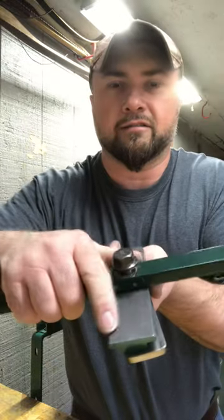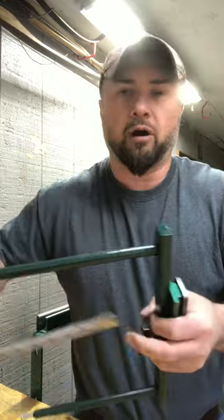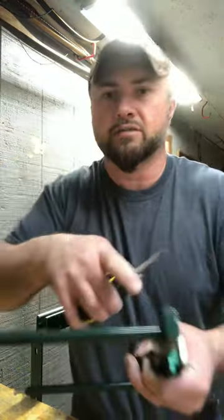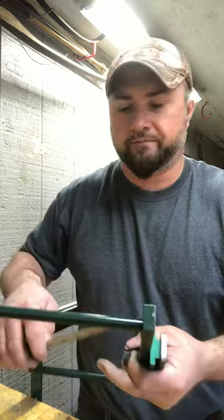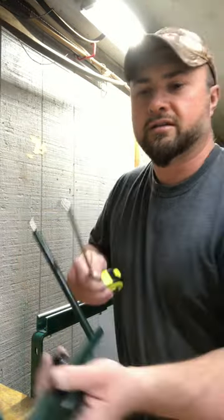You make this to slide in your rail and it'll sandwich together and clamp on your rail and let go to work. I sprayed some graphite on this top piece and underneath so no matter how many times I turn these things they won't get tight. These bars go through my plate and I weld them — smooth them off. They are eight inches long and go in here right at a half inch. I drilled the end of the rod, put the pins in, and I put Allen screws to hold my pins.